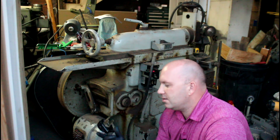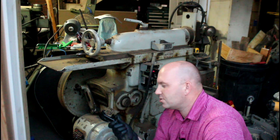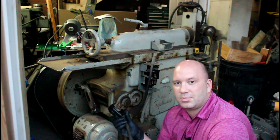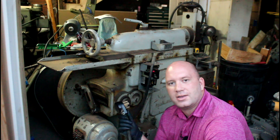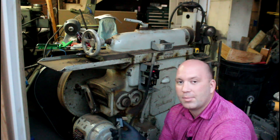And this 1430 plug they have on here — I think somebody either used this plug as a three-phase plug, or they wired this thing on there once upon a time thinking it was single-phase and hoping it would work, and it didn't work, and they just gave up on it.